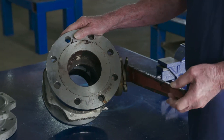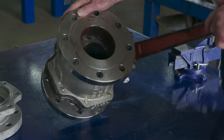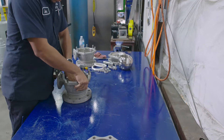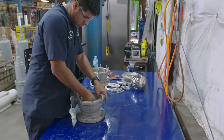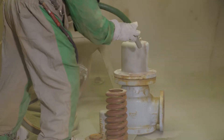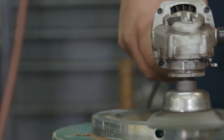The common cause for replacement is that the valve is locked up — the product builds up on the inside and then you can't turn it. So they send it in. We have to disassemble and clean them. We blast the outside with sandblast, and the insides are all either solvent or wire brush — no sandblasting.